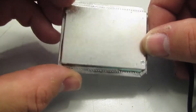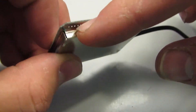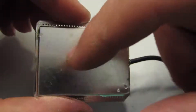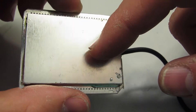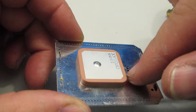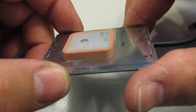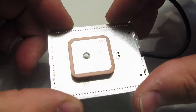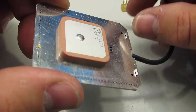I did pull the GPS antenna out of the case. There's not much to see on it — the entire thing is actually very well shielded and I don't feel like trying to desolder all of this. All we're going to find in here is some passive components, some filtering, possibly an LNA low noise amplifier. On the back side of this is a simple patch antenna on a ceramic wafer — they're very simple devices. This probably receives DC power over the antenna cable and then decouples that from the AC RF signal that it sends back to the receiver.